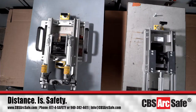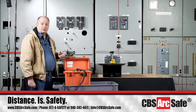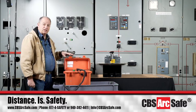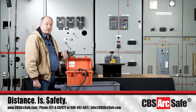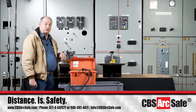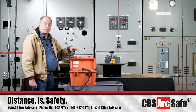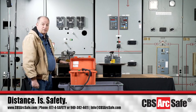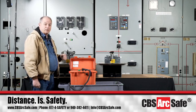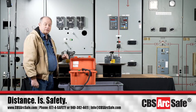One of the things I'll note about this R-frame, we've seen these in hotels, we've seen them in data centers, we've seen them in industrial application facilities as mains on motor control centers. In each one of those cases, because it's a main circuit breaker, sometimes when you don't have a 480 volt power distribution center between it and the 5 kV or 15 kV feed, these tend to have very high arc flash ratings because of that. And so this type of actuator right here is meant to keep you outside of the arc flash hazard boundary. So it's not unusual to see these in things.